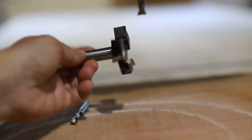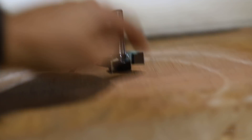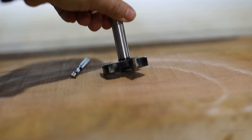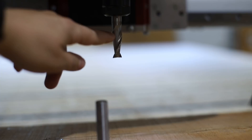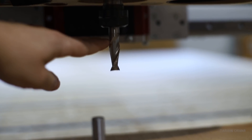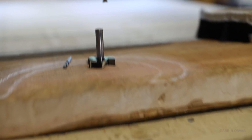This to compare with is a two inch surfacing bit, and you can see there are little carbide cutters on it. The thing with this bit is it produces a lot of fine dust — it's a different kind of cut — whereas the half inch spiral produces more like shavings, and you can go faster with it too. So in my experience, the half inch spiral is a better choice for flattening a piece of wood like this.